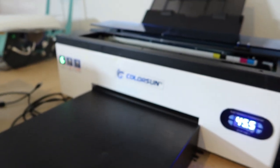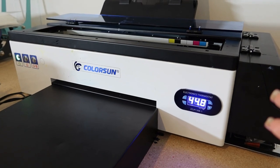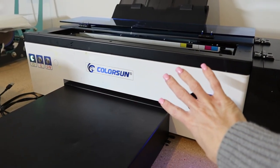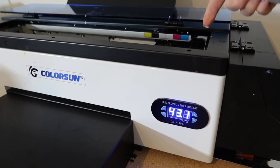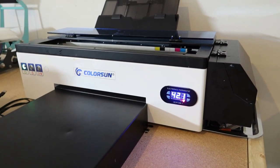Every single day: make sure your printer runs for a while, let it warm up and get adjusted. Always run a print head check — nozzle checks are personal preference. Always give your inks a shake to prevent clogs, and always empty your waste tank. Those are the most basic daily maintenance steps to keep your printer in good shape. If you go on vacation and come back, you'll probably need to manually pull the ink through the lines and clean the dampers — don't give up on your printer.